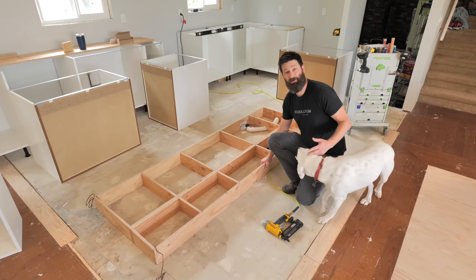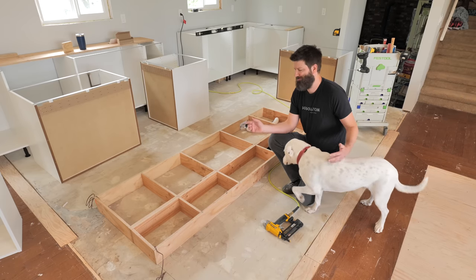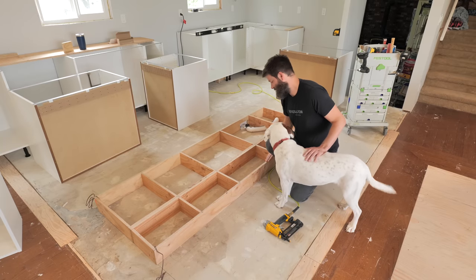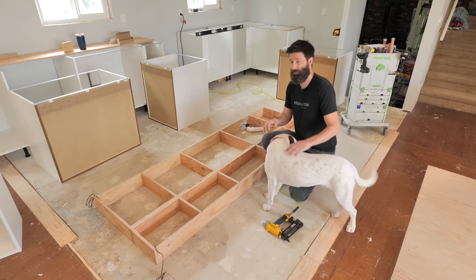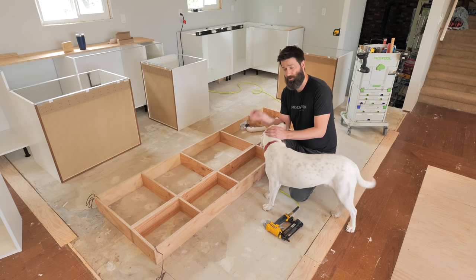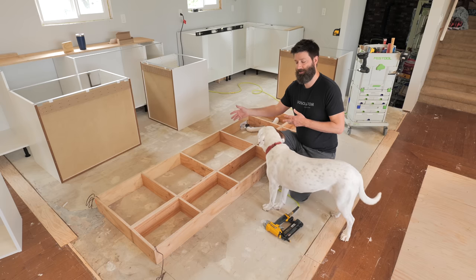When it comes to building the kicks, I built this all out of three quarter inch plywood. You could get away with five eighths plywood — that would be more than strong enough. You want to make sure that you rip these long straight pieces really straight so they don't have any kind of a curve in them. To do that, I like to cut them on the table saw. I'll cut the piece of plywood in half and then work off the factory edges.